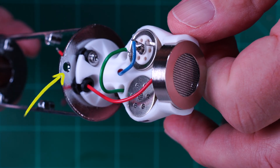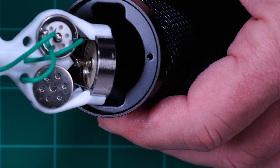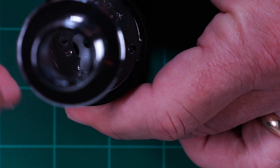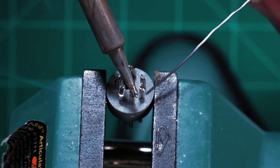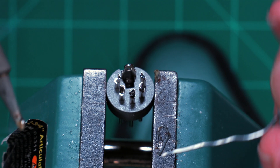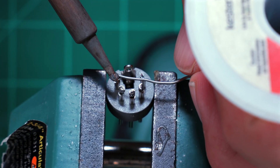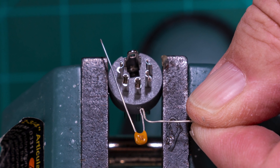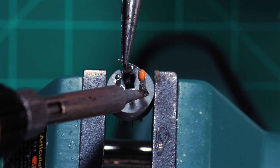Note the tab on the frame — the side capsule facing left aligns with that tab. Install the headbasket; this has two extended cutouts to let the capsule slide in. The headbasket is held in place with two short M2.5 screws. Prep the XLR connector: we're going to solder four 22 nanofarad capacitors between pins 2, 3, 4, and 5 to ground. Ground is pin 1 and also connects the mic body via the XLR screw. Tin each of the pins and prep the first capacitor. The extra lead length will connect pin 1 of the XLR to the XLR ground screw connection.